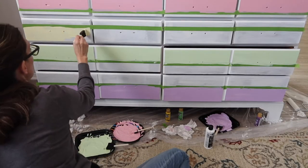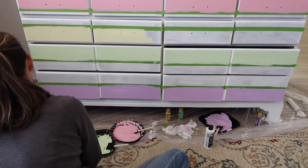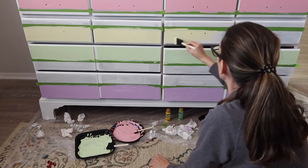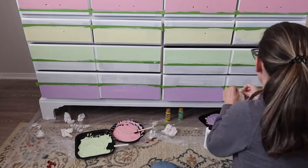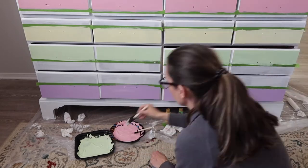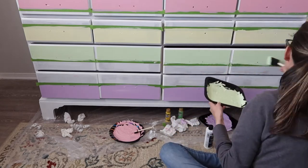When you're painting with acrylic paint, two things are very important. You want to use a primer and then when you're done you have to seal it. Acrylic paint generally isn't as durable as other furniture paints — it's definitely not an enamel paint so it can't stand alone. It needs a barrier beneath and it needs a sealer on top.